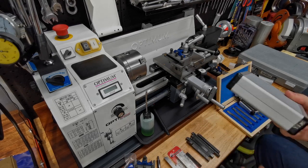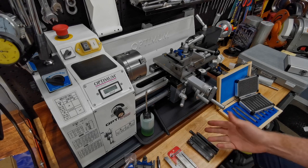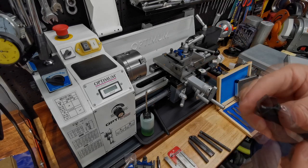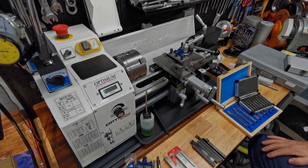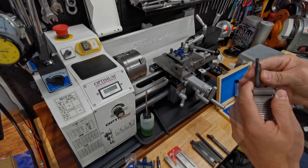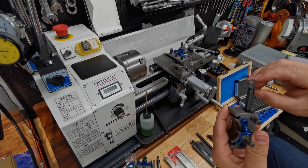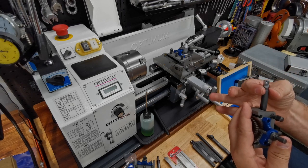Be aware that set isn't really complete — it doesn't give you everything. I then purchased another set at a very good price with even more tools: a flat diamond insert, a very sharp diamond, a threading insert, and a grooving tool — it's not a parting tool, though you can use it for minor parting tasks. It also had a boring bar, which I used in my custom washers video. I ran into a problem: the shank widens after the first couple of centimeters, and because it widens the tool deflects once you've gone in that far. I had to use it on an angle in the end.